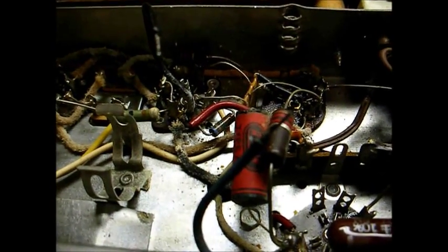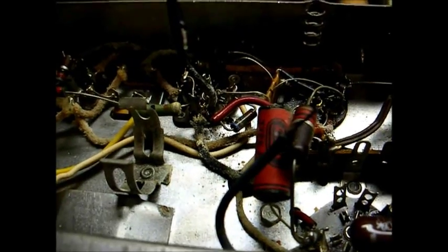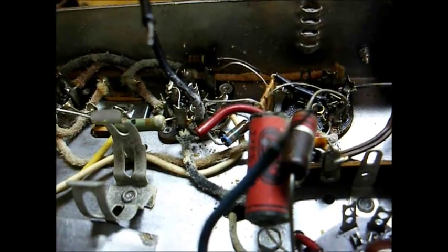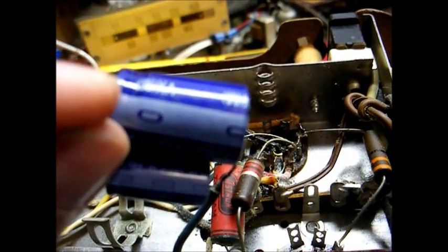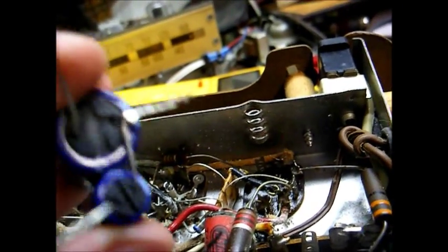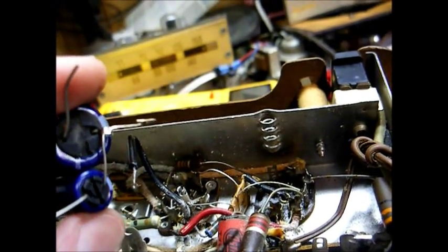Here are the three wires we're going to solder to. The blue wire goes to the 47 microfarad cap, the red wire to the 33 microfarad cap, and the black wire goes to ground. I need to emphasize something: electrolytic capacitors are polarity sensitive. It's very important that they be wired in the circuit correctly. On new capacitors, the negative terminal is generally indicated by a band with an arrow or negative symbol pointing to the negative terminal, and this should always be wired to the negative terminal of the circuit.